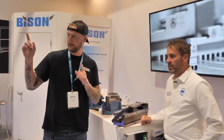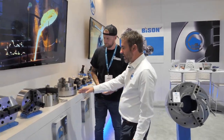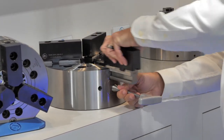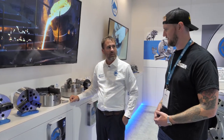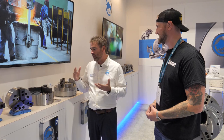There's also a new line of quick change chuck jaws. This is a hydraulic chuck — instead of standard serrated jaws, it features a quick jaw change system. You insert a tool, the jaw slides out, you change over to the next job, slide the jaw back in, and lock it up quickly. The advantage is setup time: if you're doing a lot of small to medium runs with different parts, you don't waste time counting serrations. Instead of 15–20 minutes, you can do it in minutes. If you're not making chips, you're not making money.